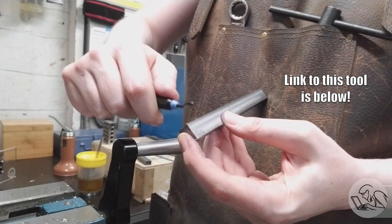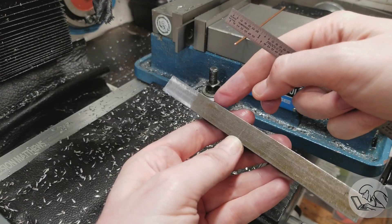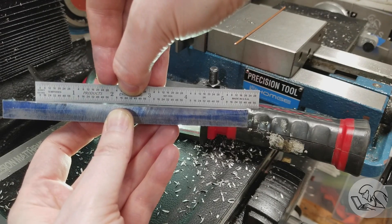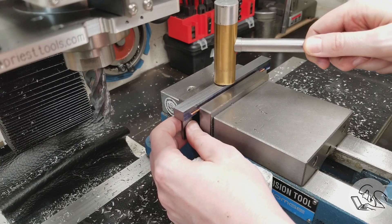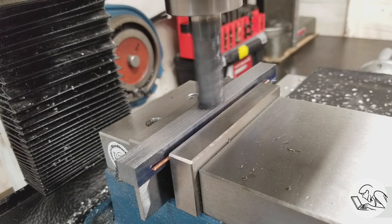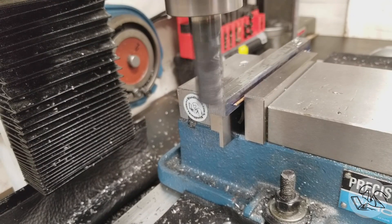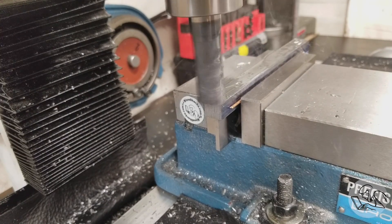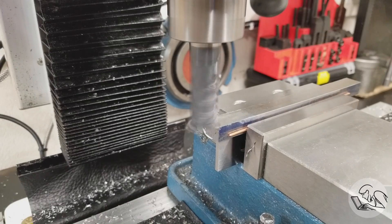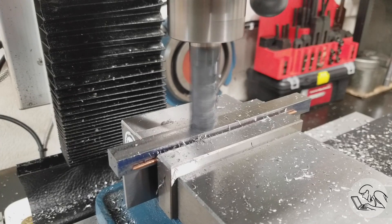Deburring between each step using my little Noga tool. On the second-to-last surface, the milling cutter drifted off — there's a pretty substantial bend in there. I put a light and a straight edge on it, and sure enough, this thing is a banana. We saw this earlier when it sprung on the saw. So I flipped it over with the stems of the banana facing downwards, touched off on the high spot in the middle, and machined just enough off to clean it up end-to-end to take the bend out. Then I flipped it over and cleaned up the other side with a very light pass.